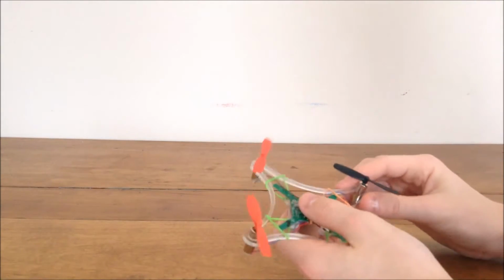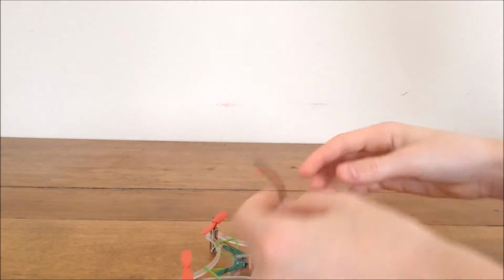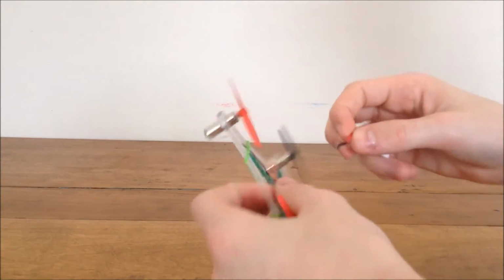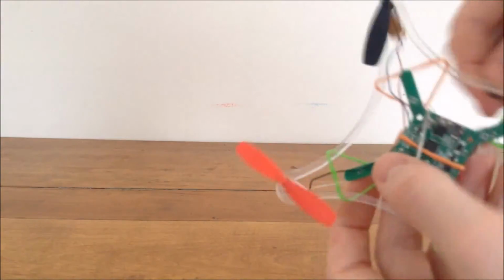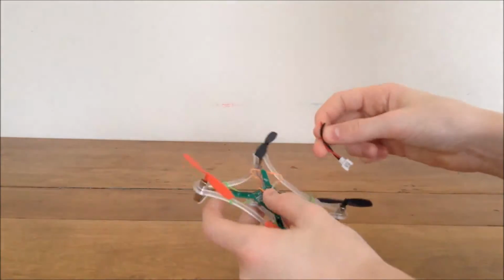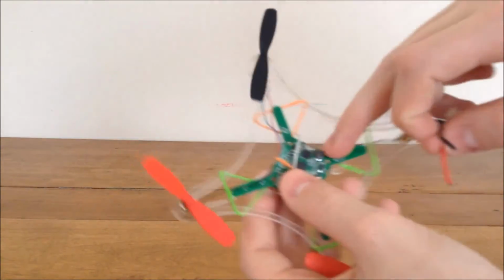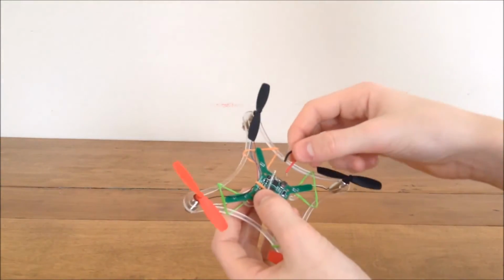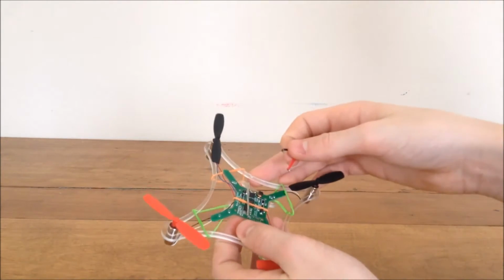I've had no breakages there, but the battery wire broke off, because on here it just solders in there and moves back and forth, like when putting the battery in and out. That broke off, and so I soldered it back on, but I must have connected two things, or maybe connected the wires together, because there was a fizz, a spark, and then half the board went dead.